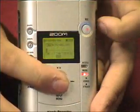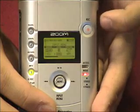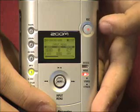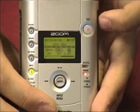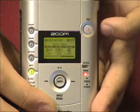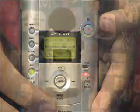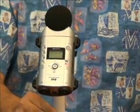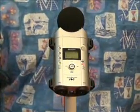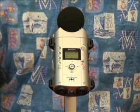Pushing the directional key down will give you access to the input menu. Here you can select everything from mic input to audio levels. You can also enable an audio monitor through the headphone port, enable auto-gain for the microphones, select a particular external mic profile, toggle compression limiting, and turn on or off phantom power. The best thing about the H4 is that a novice can literally be recording high-quality audio in two steps, while an experienced sound engineer can fully customize the recording options as needed.